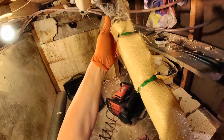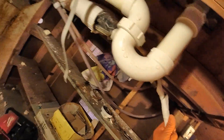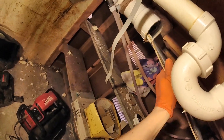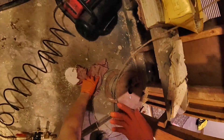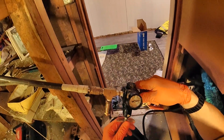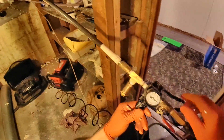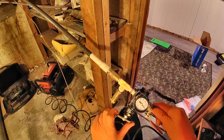At this point it's just a matter of getting into the pipe and paying attention to where the tape mark is on the push rods that you transferred over from your camera reel, which I did at an earlier step you didn't see. Then it's a matter of just hoping it's going to turn out the way it should, that you did your steps right. Connect the air. The steps of the training will include how to figure out what air pressure to set your packer at — you're basically putting in a piece of pipe with holes drilled on the side so you can see when it's inflated all the way, then marking that depending on what temperature you're in. It's not that difficult. So now we're going to wait about an hour and then come back.